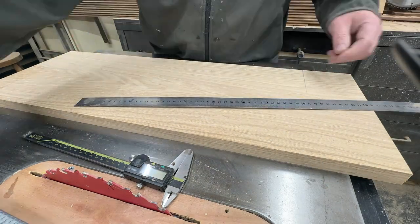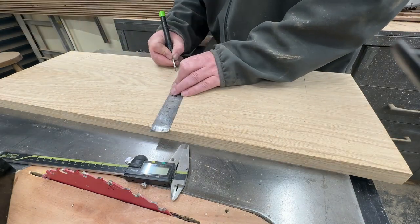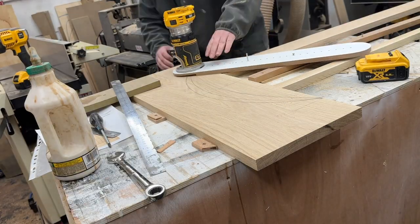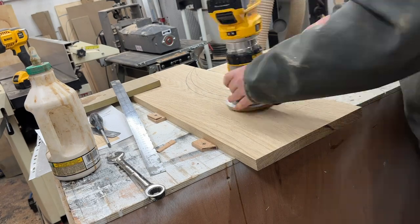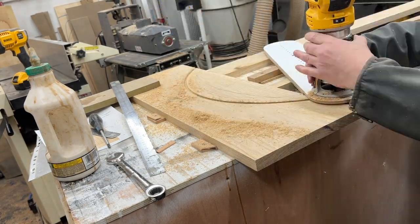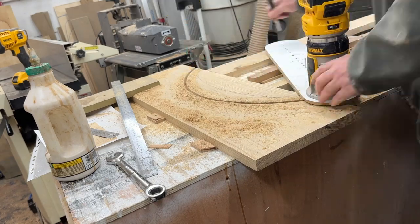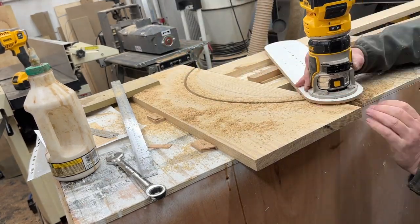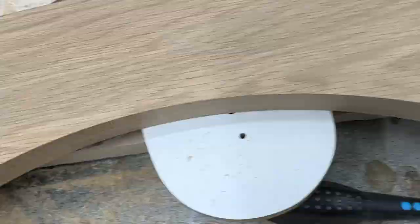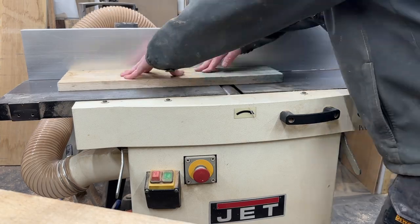The door is 30 inches wide, so I start working out what diameter would look right for the arch. I flex a ruler and try a number of different profiles to work out which arc is visually best. I then use my circle-cutting jig, set the dimension so the router touches both stiles, and take four or five millimeter passes with the router — about a quarter inch — creating that curved head so the slats have somewhere to rebate into. A little hesitant taking it on without a spindle moulder, but the right call.